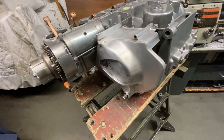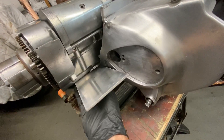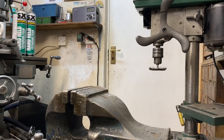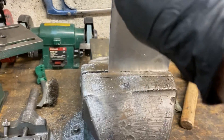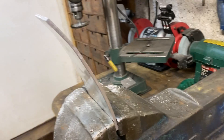Back in the garage I got my little bit of plate that I'd just cut out and offered it up to the engine to see that it was big enough. As you can see it's straight — it needs to be curved and it also needs to be contoured to fit the side of the engine. To put the curve in the sheet of aluminium I gripped it in my vise and just pulled it by hand. It's quite stiff but I managed to do it.